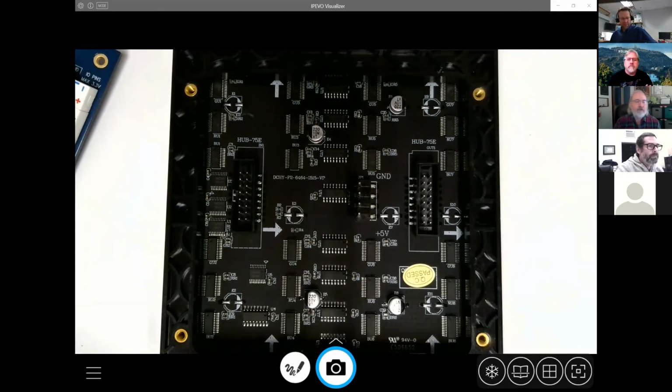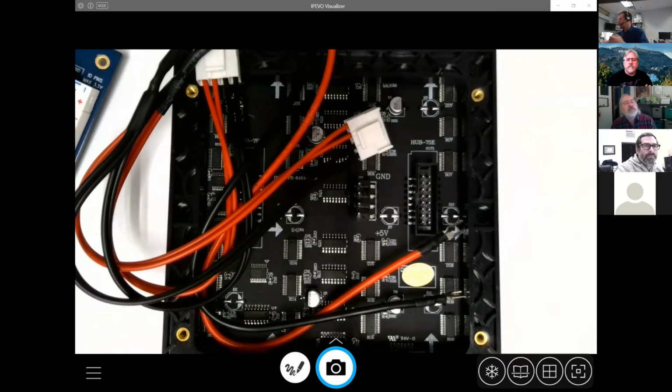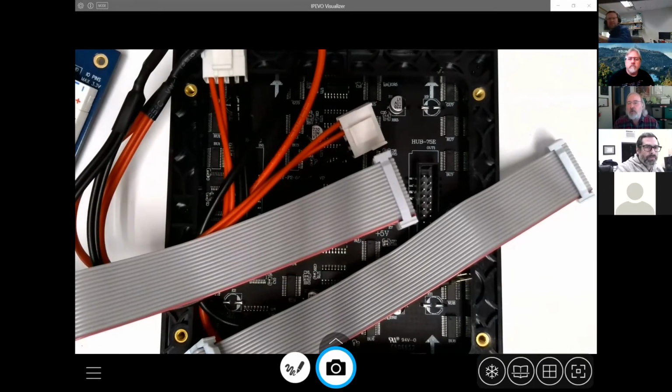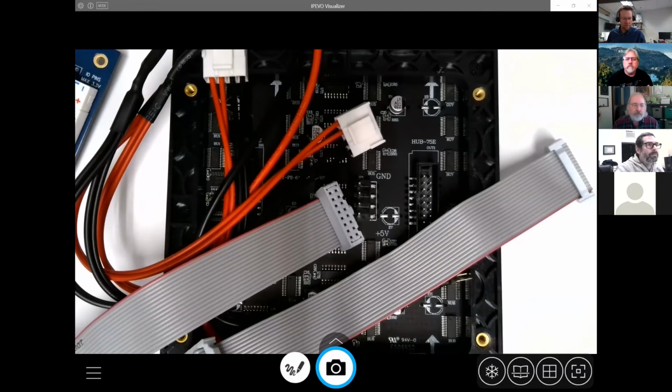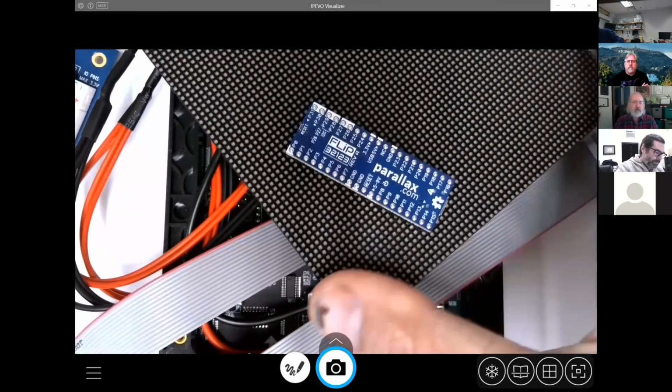Yeah, and these panels come with wonderful cables to connect them, and definitely they'll hold the current. The power cables, yes. The data cables, I bought some cheapy 3 times the length cables, and those do not pass the signal well. So we're going to have to be careful about distance between panels when we go diagonally in rectangular arrays. I think we could even drive 2 or 3 banks to get to 6, if we wanted to run the HUB75 driver on multiple cogs and just have multiple cogs deal with just a couple panels each. You absolutely can, yes.